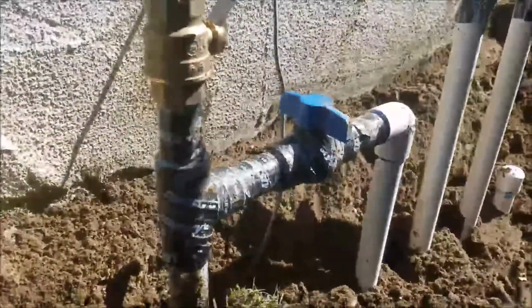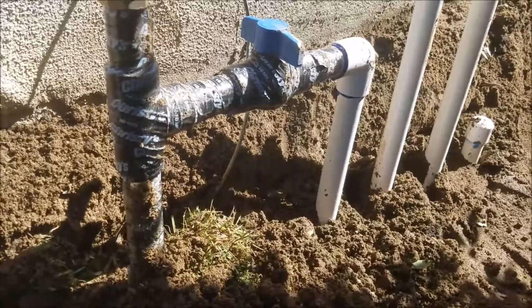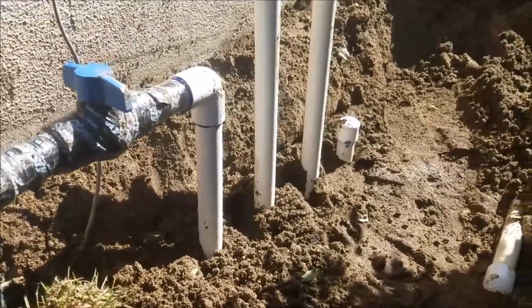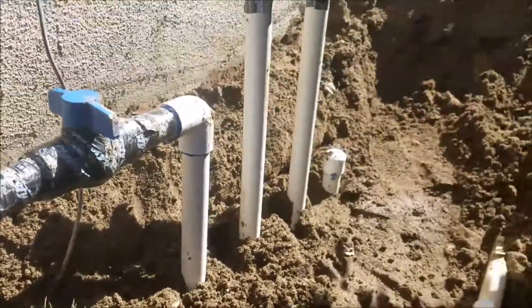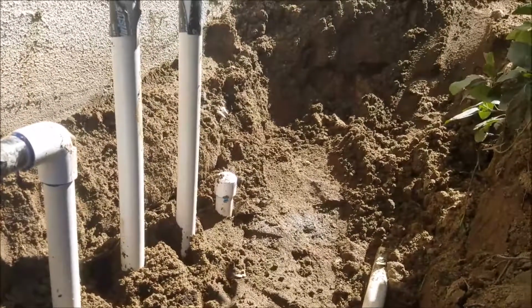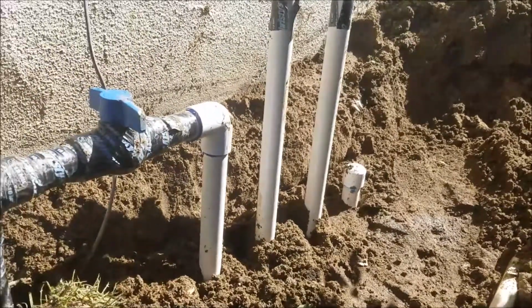We've gone ahead and sanded this in. We've got about 300 pounds of sand in here. Sand settles the pipe so that there's no pressure. We got sand around these risers. We got sand around this riser, and then we filled it in with your existing soil. It's pretty wet, but it is a sandy soil, so it compacts pretty nicely. Just let this dry out.